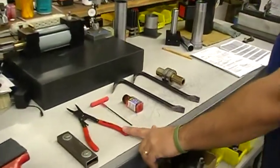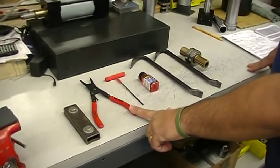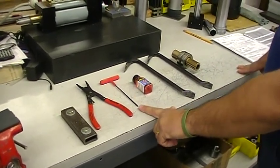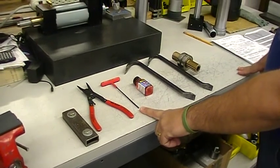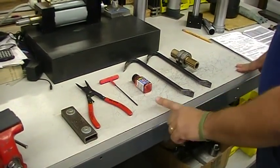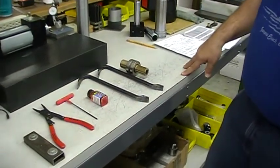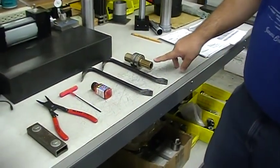The first thing we'll start with is the tools that you will need for the changeover. You will need a snap ring remover to take off the retaining snap ring on the drive spline, an Allen key to remove the set screws on the pulley, and pry bars in order to get the pulley and the spline drive out, as well as your new spline drive.